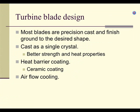When doing inspections on turbine wheels, you have to look for what they call coating loss. You'll see a very small color change in an area — it almost looks like something has flaked or peeled off. Coating loss means you'll have to reject the blade because it no longer has that protective coating. You'll see this heat-resistant ceramic coating on many turbine wheels and turbine components.